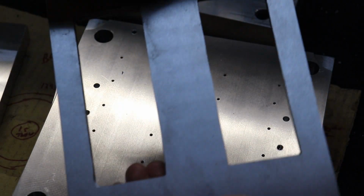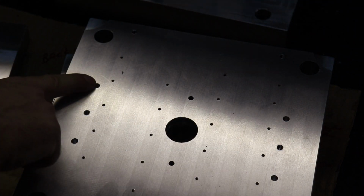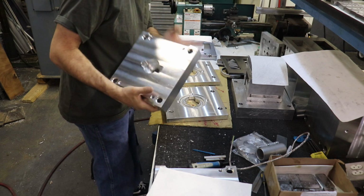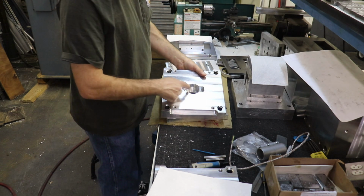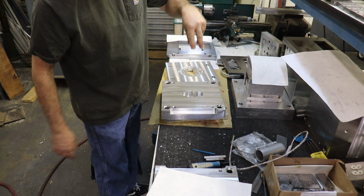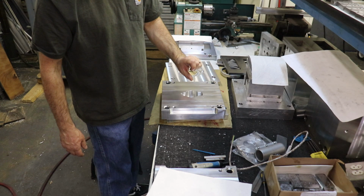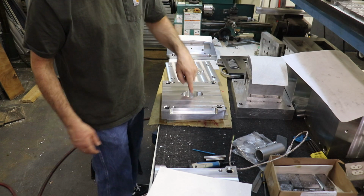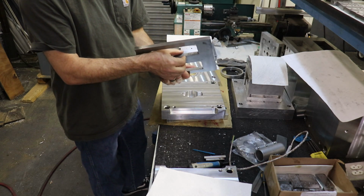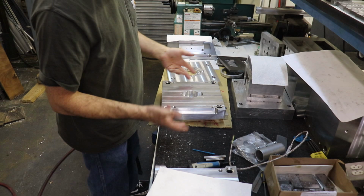So next step is we are going to machine the finished profile of these reference plates and then key them into these dowel pin holes that we machined into the mold surface. And then the back of the A side of the two mold pairs, we've machined out the clearance for the nozzle on the molding machine itself. So the nozzle is basically what is going to pierce through basically the entire A side of the mold. And the hot nozzle of the injection unit of the molding machine will basically touch off on the back of our steel plate. So our entire sprue height is only going to be about half an inch, which is going to be nice because it's less scrap that we have to basically waste in just runners and sprues.